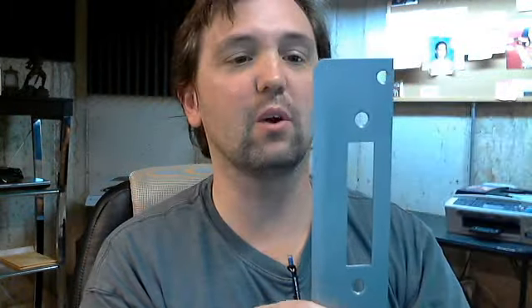Let's take a closer look at that. The dimension from the back side of the strike to where the lip begins is two inches, then the lip is a quarter inch. That description is incorrect — I would call this a two and a quarter inch. Donjo might be getting the inch and three quarter from the center line of the screw to the lip, which is very likely where they're getting it from. Hard to say, but those are the dimensions that are important to know.